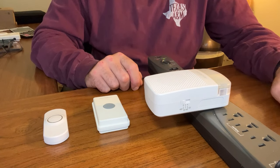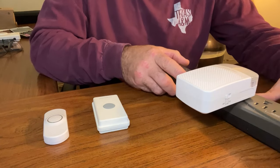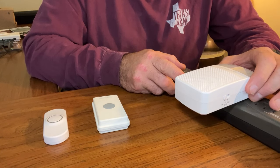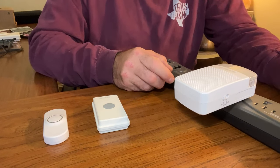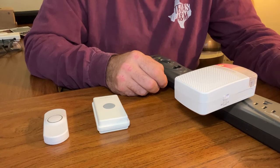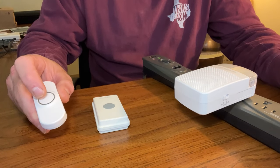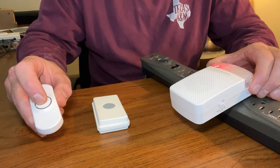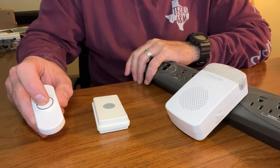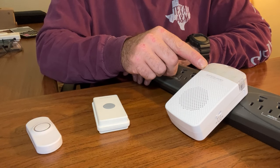The first thing we're going to do is hold down the mode button on the side for approximately three seconds until we hear a short tone. The first available melody by default is a basic ding-dong sound, and that's what I'm going to use for the ERA-PBTX. You can see the red LED blinking on the receiver — that just notifies you that it is in programming mode.